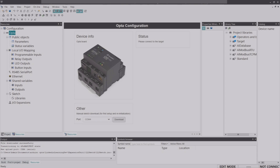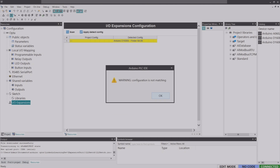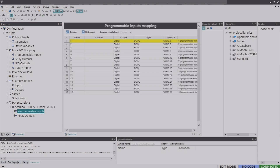Once you've finished downloading the runtime, click Connect to Target. You'll see on the right-hand side that it's connected. However, we don't have anything set up for the expansion unit yet. Go to IO Expansion under Resources and double-click. We need to scan for any connected units — click Scan. You'll see a prompt; just click OK. The software will detect the expansion unit. Apply the detected configuration, and you'll see the unit appear along with its programmable inputs and outputs.